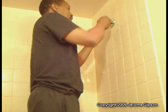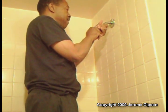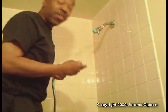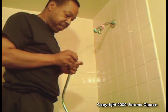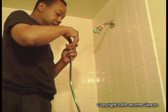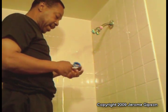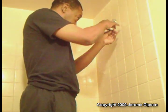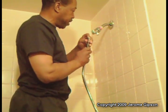That feels pretty good. I'll leave the rubber band on there until I'm done — in the end I might take a pair of scissors and cut it off. That's part one. Now we'll put the hose on. I'm a typical guy, so I didn't read the instructions. But they've generously supplied us with three washers, which is probably what we need: one to go in here and one in either end of the hose. Wherever there's a connection you should have a rubber washer. Just to make sure it doesn't leak, I'll put some Teflon tape on this as well — always going in the same direction as the thread, just once or twice around. That's enough. This is the end I put the washer in.